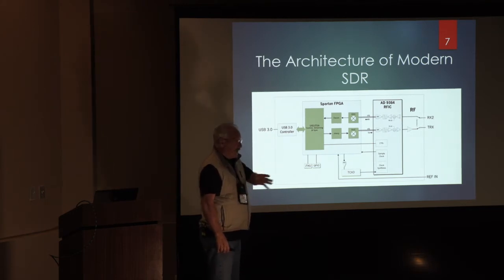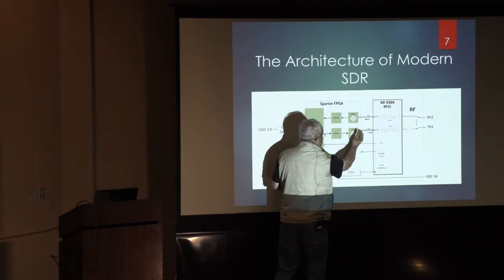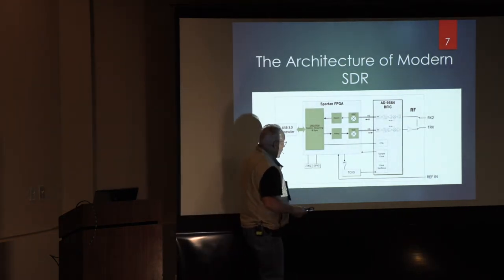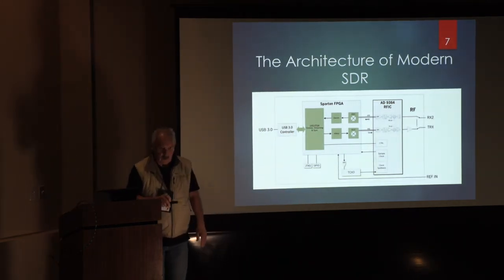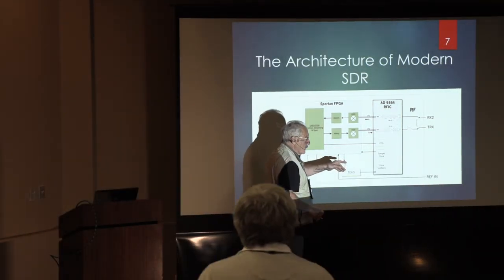They're pushing more DSP into the FPGA as time goes by. Someone noted you're showing a device that's directly digitizing the RF with no conversion whatsoever — what is the frequency range? 40 gigs. This chip's RF side is nominally 0.5 through 6 GHz. On the baseband output side, I think they say 56 MHz in the specs — baseband is frequencies around 0 on up to 56 MHz here.